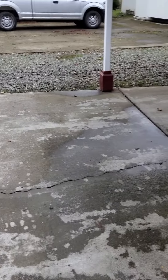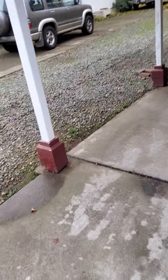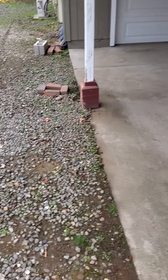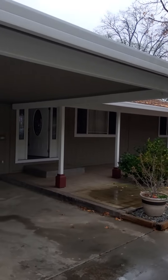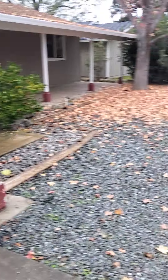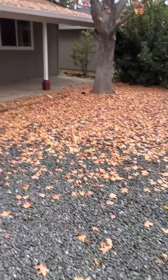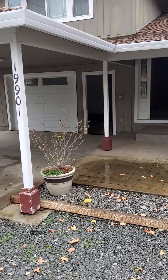I haven't checked the attic crawl spaces yet, so I just want to do my exterior video. I had the selling agent come by earlier and let her know we had the buying agent turn off the hot water heater. I'll be turning it off when I'm done. You can see why we got water — look here, water is dripping. We talked about the roof, and just look at how long these runs are. There is no downspout where that valley is going down.